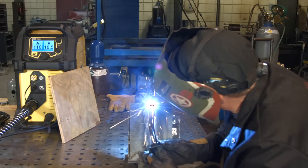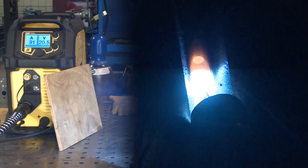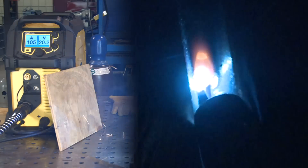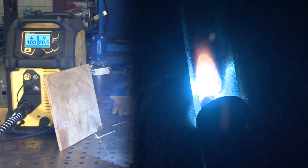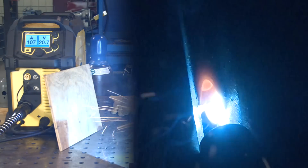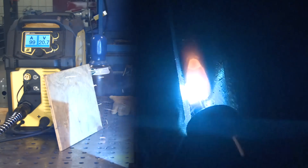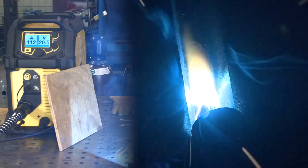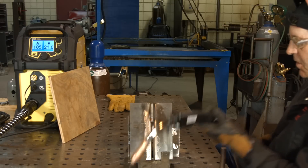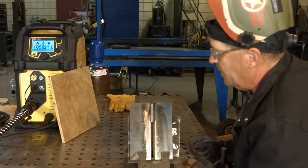Let's dance. Just a first indication here — it's nice and wet, meaning I could probably turn up my wire feed speed. I'm going to do about a third of this and stop, because I want to make a value change and have you see it and listen to it.